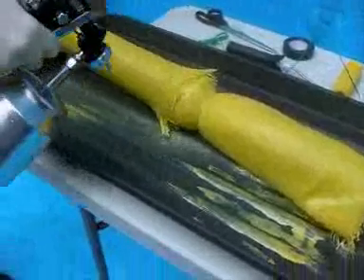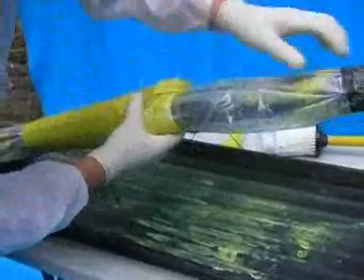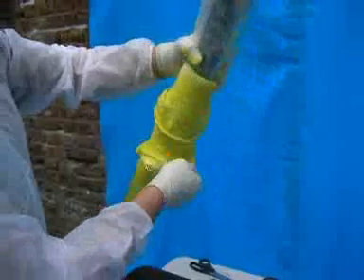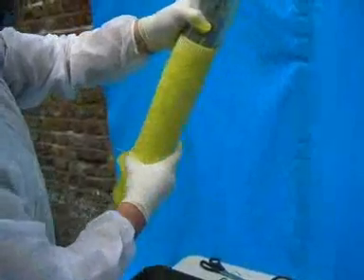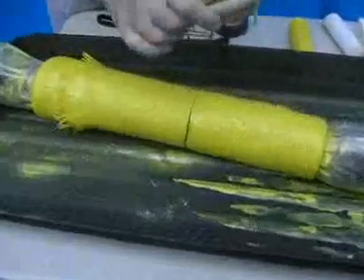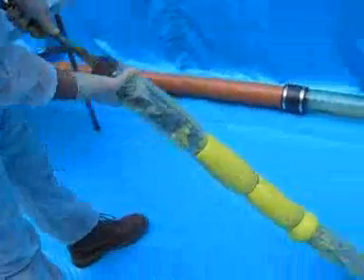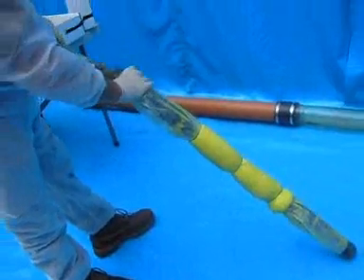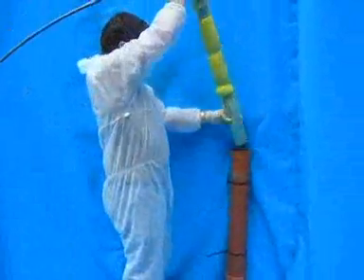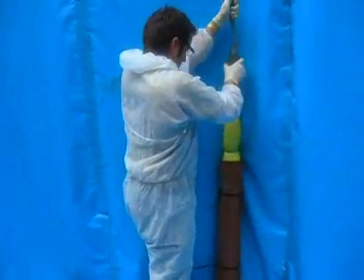With this system, all leading edges are firmly secured with no straight edges that may snag and consequently allow the sleeve to slide when pushed or pulled into place, around bends or joint displacements. Due to the sheer speed of dispensing the resin onto the fiberglass tube, the first two stages are typically completed in a couple of minutes for a 2-foot by 4-inch point repair. This represents a major time saver when compared to alternative methods of CIPP point repair.